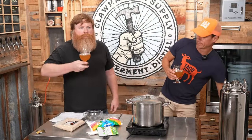In a brew day, if you do the wrong thing, this way you can't remove it without releasing the pressure. And one more thing, we put an L on the end of the tri-clamp here because we talked to professional brewers and they said the number one risk with tri-clamps in a professional brewing setting is that the thumb screw is not tight enough and it pops over, it literally just comes off. You can get a tri-clamp tight without it being too tight to open. So there's no way you can do that. You actually have to release it to the point where this is loose now, the pressure's off, and then you can take this off and remove your cap or your hop dropper or whatever you have. So that's the quick update.